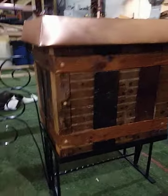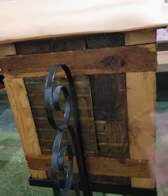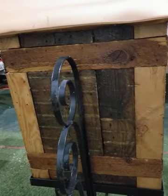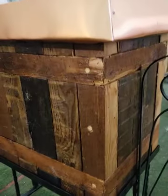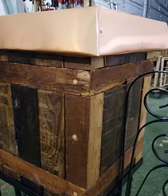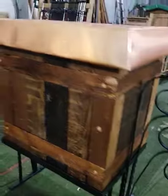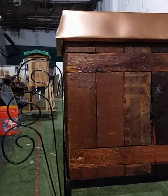Here's the back side — it looks a little different because I have some different boards and sections. These two on the end are really light because I had to trim them down; they were long and stuck out past the end of the side, so I just squared them up. Then I took another piece of that old pine stud and ripped it in half, glued and stapled it across them to hold it all in place. I put a couple of coats of spar urethane on it — oil-based exterior — just trying to protect this thing as best as I could with something clear that lets you see what it is. It's got a satin finish, a little shine but not too bad.